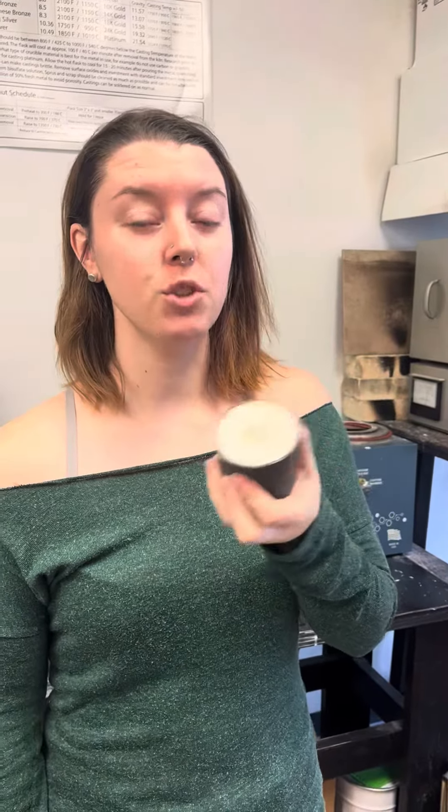So if you have an issue with your cast — whether that's because the power goes out, there's a family emergency, whatever it is — you can power down your kiln slowly, save your flasks till later, and then pour the metal at a later date.